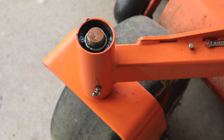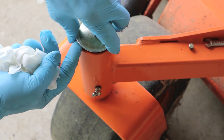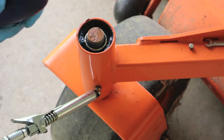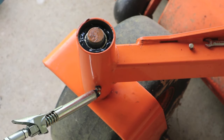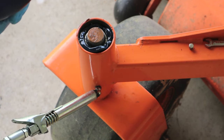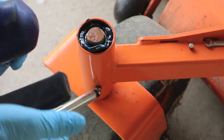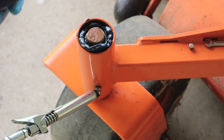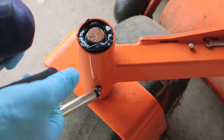We'll try this according to the Scag procedure. Just tap up on it like this with a small screwdriver, very carefully. Get the cap off. Now let's grease it and see what it looks like as the grease comes up. You can see it coming right on up through there. It feels like a tight clearance in there — I'm not sure if it's a bushing or a bearing, but it feels like there's not a lot of excessive clearance for the grease to migrate to.